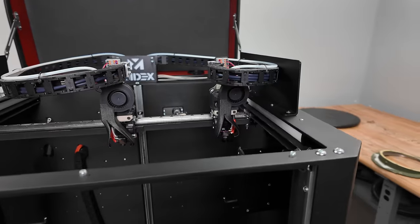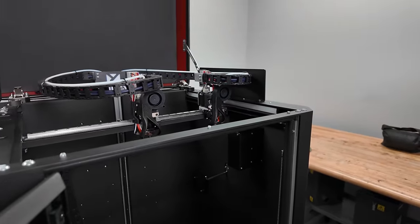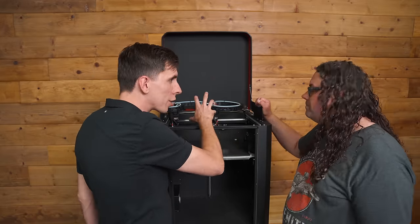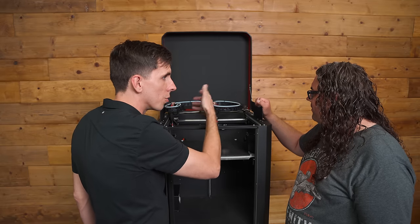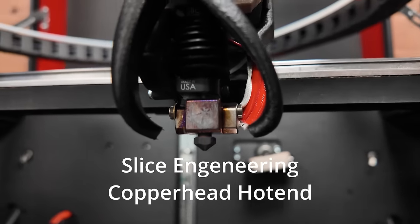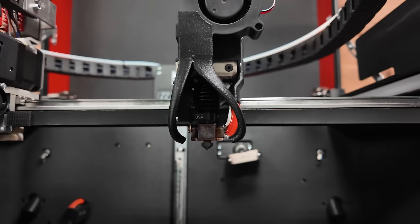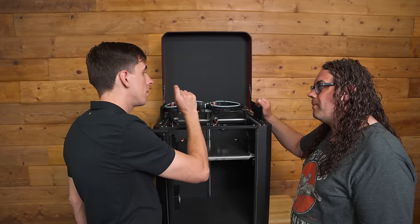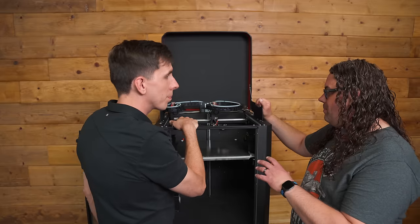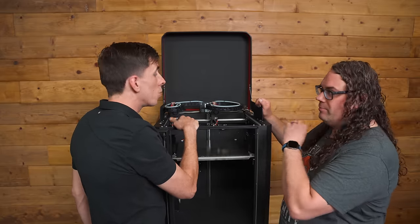Take the best — we don't have to design all of our own things. Take the stuff that works amazingly well and use it; it's a shortcut to being better. Why reinvent the wheel? These guys focus only on extruders, they've got the best extruders. Down from there, the cooling fan and shroud lead to the Slice Engineering Copperhead hot end. It goes super high temp and gives us the advantage of easily matching the Z offset of both heads, because the machining spec is so tight you can match tolerance on each one pretty easily.